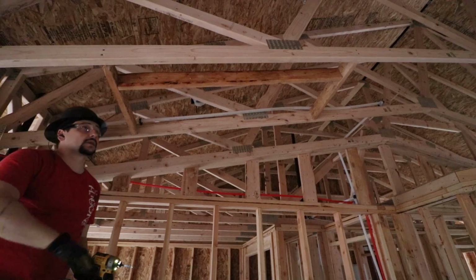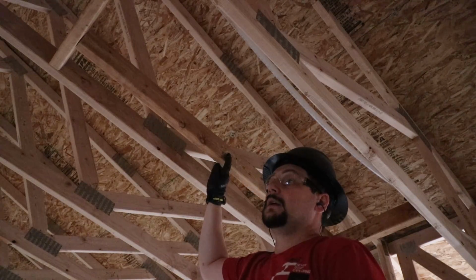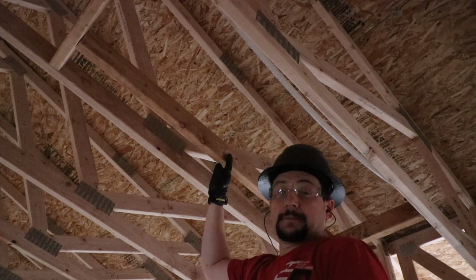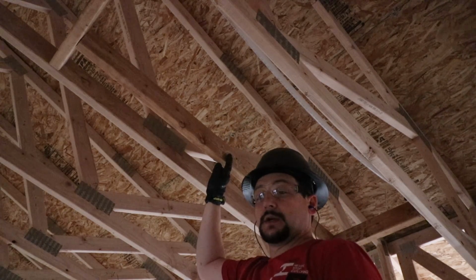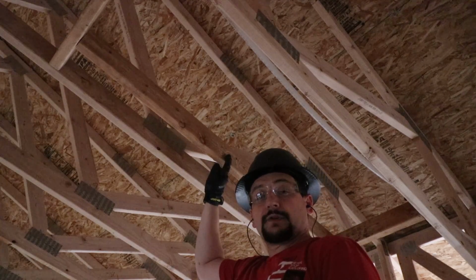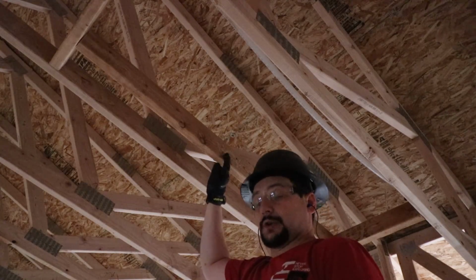All right, so we've installed our brace. This is where the sprinkler head is going to be located. It is directly in front of the stove, and it is 1.5 feet away from the front of the stove in the ceiling. Now, it's very important that the bracket get mounted in the correct place in order to position the sprinkler head in the correct place for when the sheetrock is installed.